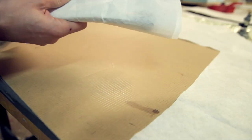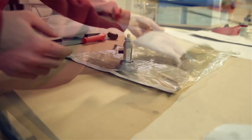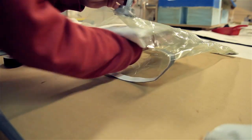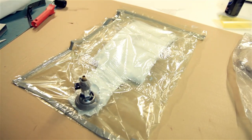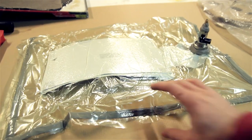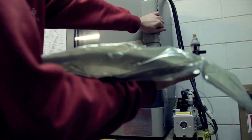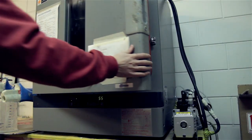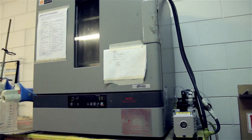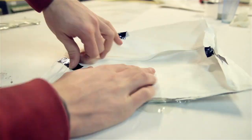Here I'm using the breeder fabric. There might be a small mistake — the edge of the mold might have been taped off to prevent any resin bleeding out into the breeder. Everything is stacked into the vacuum bag — a recycled bag from a previous project, but still perfectly fine. A perfect vacuum is achieved; I did a drop test and everything worked out well. Then everything goes into the oven. This might be a restriction — it has to fit into the oven, like with any pre-preg. Unless you are NASA, you don't have an enormous oven, so this is mostly for smaller pieces.